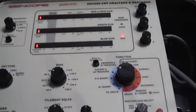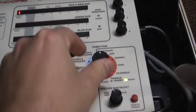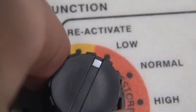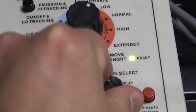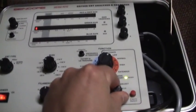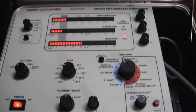Going to try low reactivation — this one's only two seconds at 40 milliamp current. Nothing to lose here. Watching the meter — and go. After a few pulses on the blue gun — look at that! The blue gun came back. Somewhat.